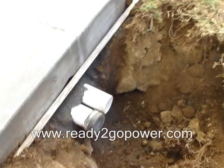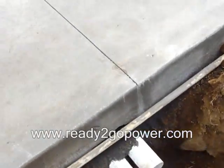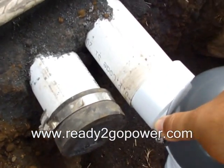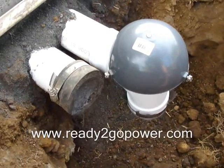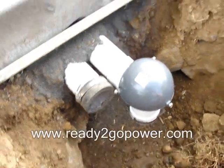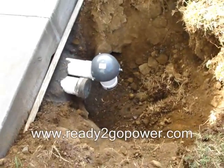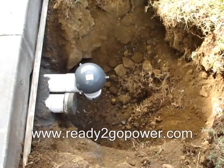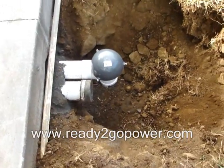We could be done by just gluing the vent onto the pipe and leaving it like that. But the way I did it, I want to get this as low as possible — in this case, lower than the slab. We'll want to put some gravel in this hole and a way to protect the top of this thing. I'll be showing you that next.